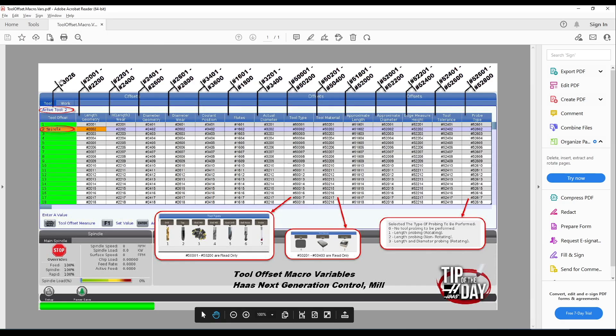In the bracketed range, the first number 3026 has a pound sign; the second one doesn't. It ends up, after you realize it, it's pretty simple. If you look at this sheet, #3026 is our active tool number. So if you have tool 21 in your spindle, the variable #3026 will equal 21. That's the tool number — it's not the tool Z length. And that's what we're trying to do here: I want to stop the machine from running if the tool length is still zero.